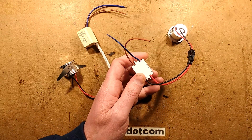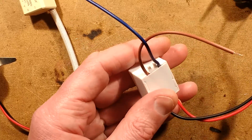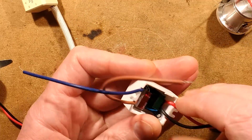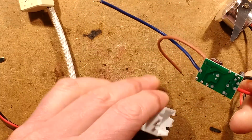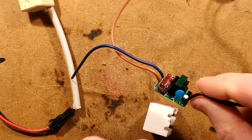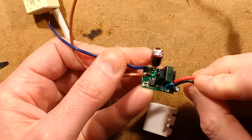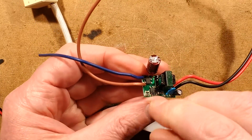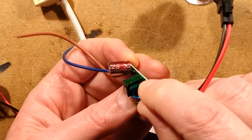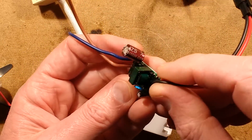Let's pop the power supplies open. This one has the classic arrangement: a bridge rectifier, a smoothing capacitor — quite an unusual colour — rated 2.2 microfarad, 400 volts, not super generous. It also has what is theoretically a Class X interference suppression capacitor, which is interesting. The chip inside has text that's tiny and difficult to read — something like Z6KL7L or DMO — one of those vague cloney-type chips. It will have a similar topology to the classic BrightPower-style chips. BrightPower were one of the first to really commercialize these.